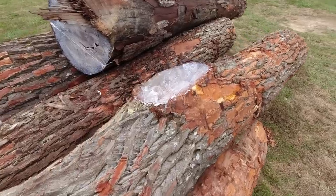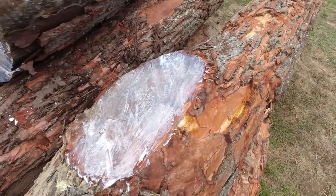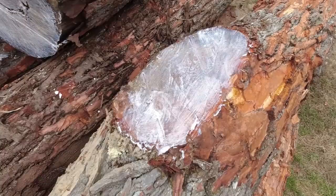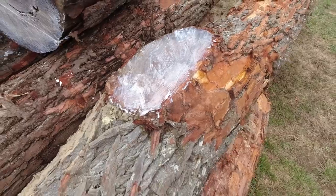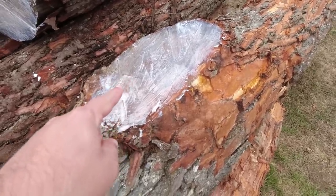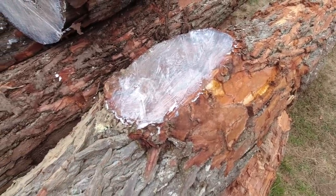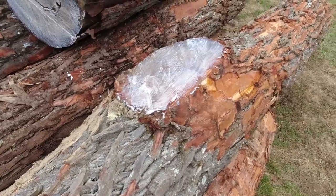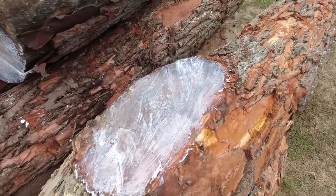And something else to note here, guys, not everybody does this. If you've got a large knot on the side of your log, that one right there is probably about 16 inches, put anchor seal on it, because that is ingrained just like the end of the log, and you'll have checks right there as well. Even though it's a knot, and some people will try to saw that off the log and get rid of it, you don't know what's going to happen when you put it on your sawmill, and you may be stuck with it. So anchor seal it.